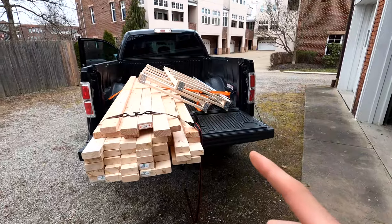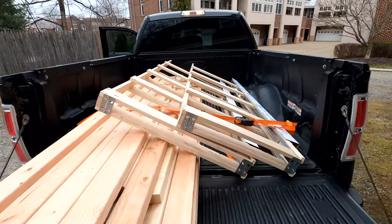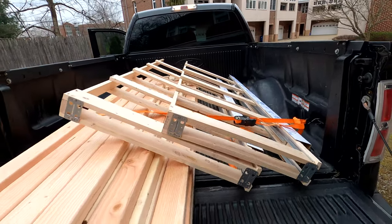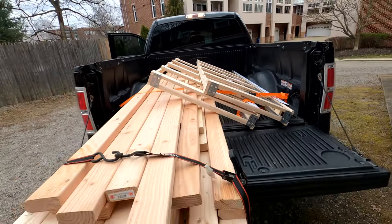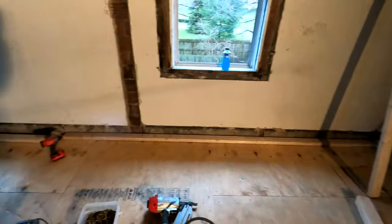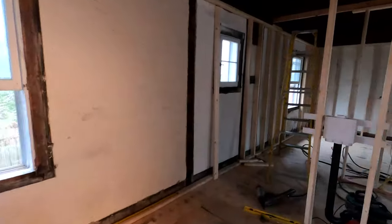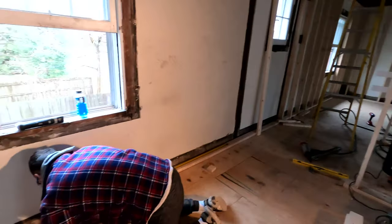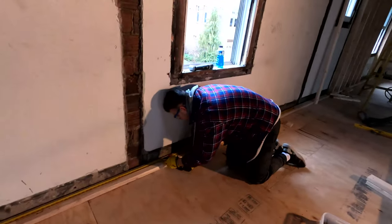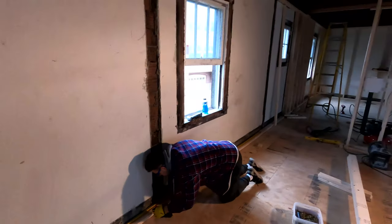We made it back with the lumber. We also bought two pocket doors - gonna get those in soon and show you guys that. For now let's just unload this and keep moving. We'll run these base plates, then top plates, then run all the studs. We're making our way down this main wall; Chris is marking out where our studs go, just keeping it moving. We'll show you a time lapse here.